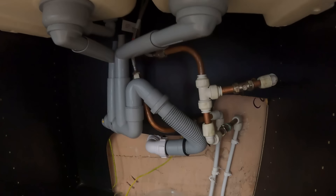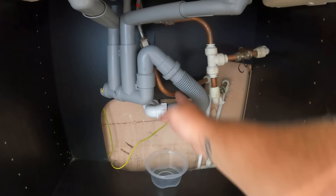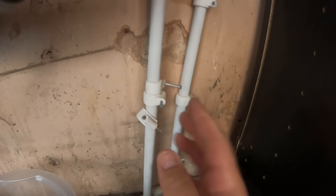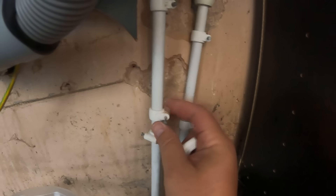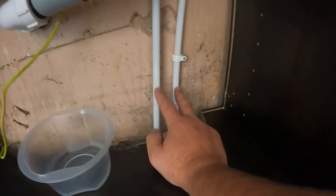They've also said to me when I came to do the job: could I tidy up the mess of pipework underneath the sink? So I just opened the doors and yeah, they weren't kidding. This pipe here is obviously the cold that goes out to feed the outside tap — cold here, hot there — but it's just sort of thrown in. Whoever did it in the first place clearly didn't want to go to the van and get the proper wall clips; they just nailed it back with nylon clips. So we'll get some proper clips on there, and I'm going to fit two full-bore butterfly isolation valves low level, cut them in, then repipe it to make it look tidier, and then get the tap in.